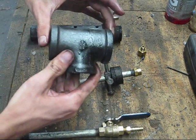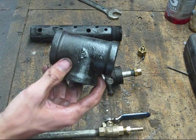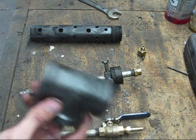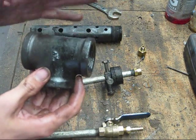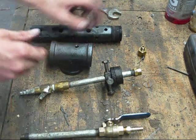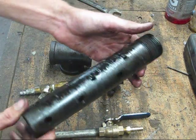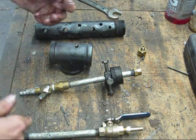Finally, you're going to need a one and a quarter inch black iron tee. You don't have to use one and a quarter — you can use anything bigger, like one and a half or two inch, as long as it's black iron. You will definitely have to use black iron for this. Then your afterburner is nothing but a piece of one and a quarter inch pipe about ten inches long. Now let's assemble this.